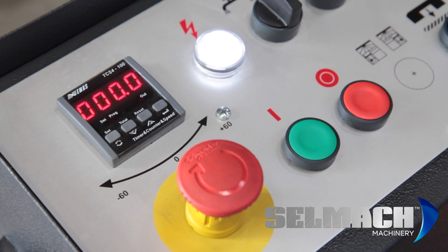This is your digital readout screen for your cutting angle. As you can see, as you turn the bow, your digits change to a new cutting position. From time to time, this will need to be recalibrated to make sure we're getting the correct cutting angle.